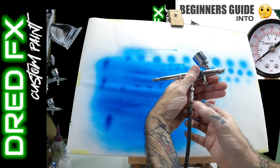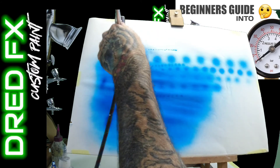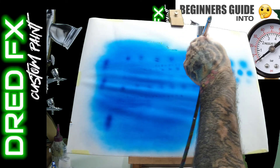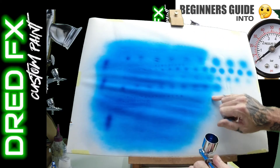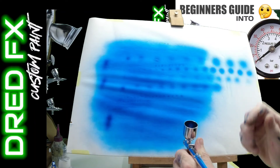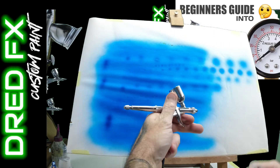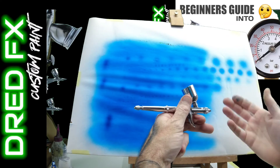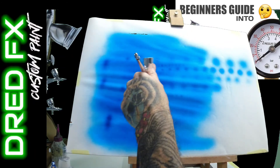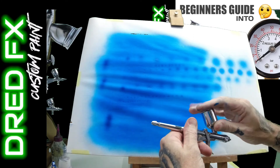We can drop the pressure down - I've got a gauge here so if we wind that in, that brings the pressure down and it's still a little bit speckly. You could drop the paint consistency down a bit more, thin it, and it would atomize nice and soft. It's going a bit grainy there but that's the PS290 running at 25 PSI. Thin your paint down slightly, or if you want to put a thicker paint in, bring your pressure up to about 30-35 - working pressure on these you can go to about 40 PSI.